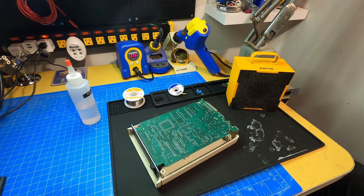And if you're wondering why the case is off on this thing, it's because back when I originally got it, it had an issue where when I would plug it into the phone line and turn it on, it would immediately go off hook, which it's not supposed to do. It's supposed to get that signaling from the computer that it's interfaced with to go off hook when it needs to, or it's supposed to pick up a phone when something ringing comes in. But no, it just went off hook.